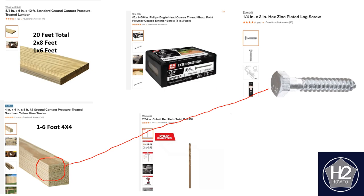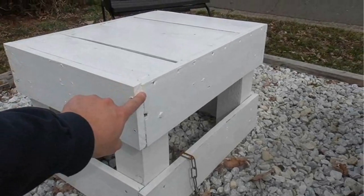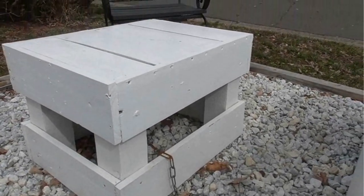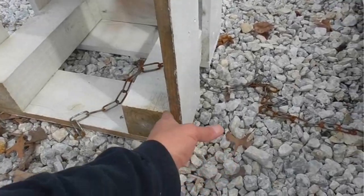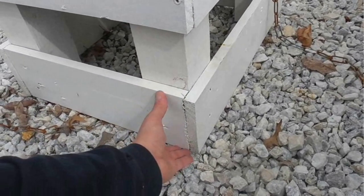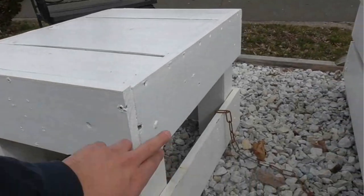The next slide is a video indicating the process and the finished product. This is the table I made for this bench. I used the same six-inch boards — this board right here is the full length width of this particular piece. I used four by four posts, just four in the middle. I attached this one to the 4x4 post using two-inch exterior screws. In this shot we see the 4x4 post and they're flush — the bottom 4x4 front, back, and side pieces are flush with the bottom of the 4x4. This top board is drilled into the top of the 4x4, and this piece right here just lines up to make sure it's flush. You can also see the lag screw that was used right here.